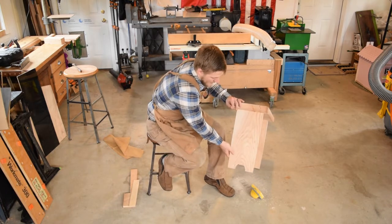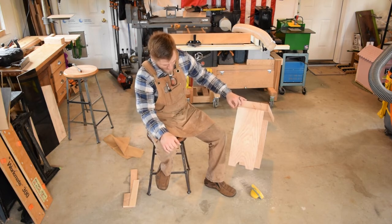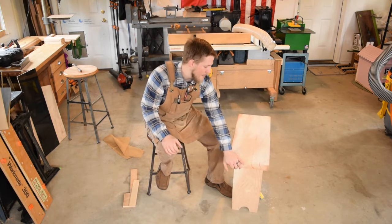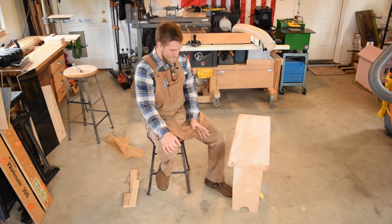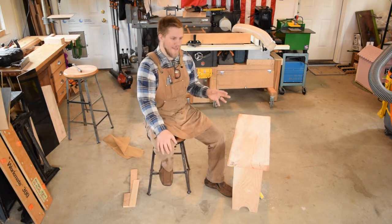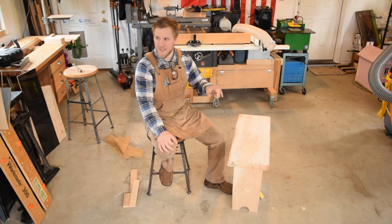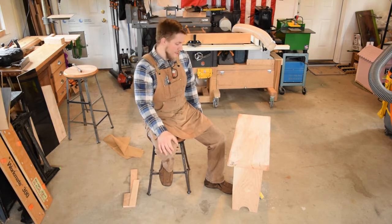The other one is I've actually tapered on the wrong side of the bench. In reality, you shouldn't be taking away material from your feet, but that's just how it came out in the project. Other things that kind of went wrong is the bandsaw was one of the only tools that I didn't double check in tuning, and as a result, the arcs cut in the bottom are at like a 4-degree angle, so they didn't really cut very well when I was trying to use the rotor rasp on my drill press. So that was another thing.